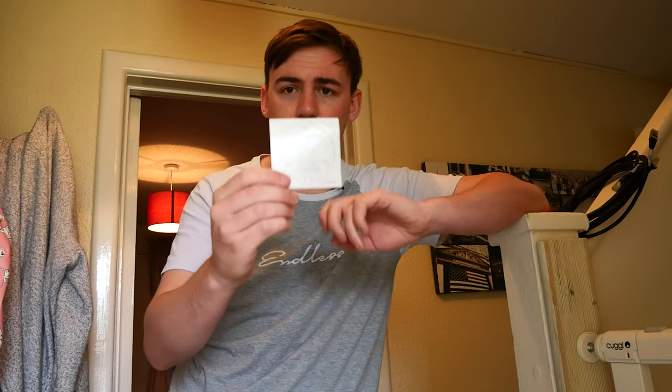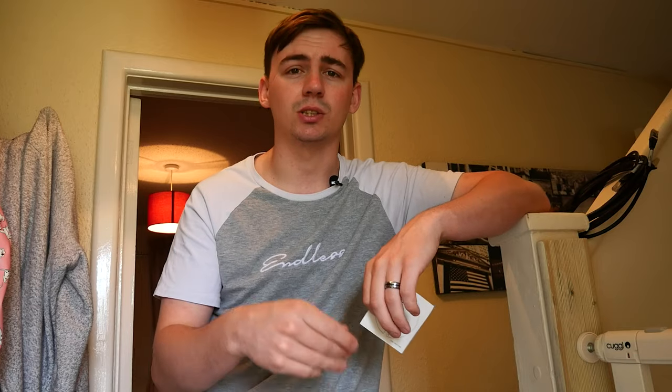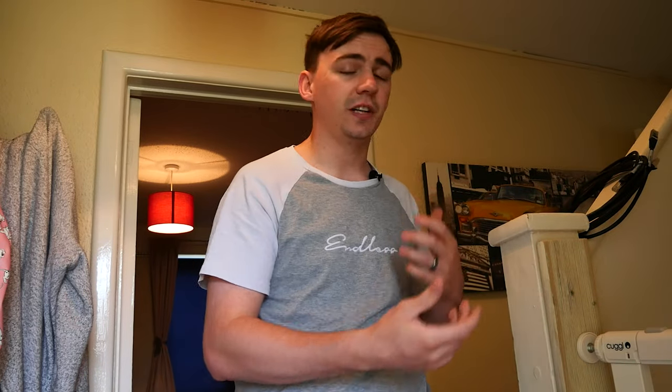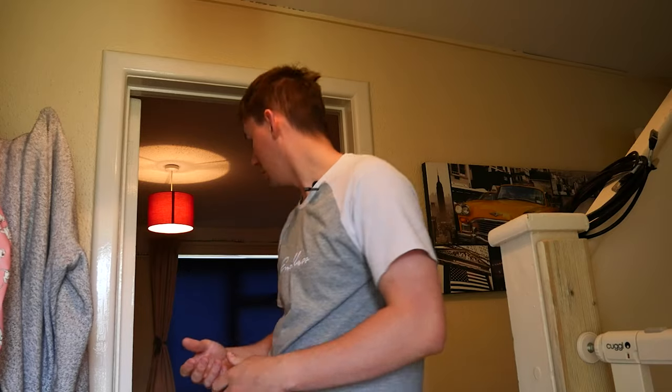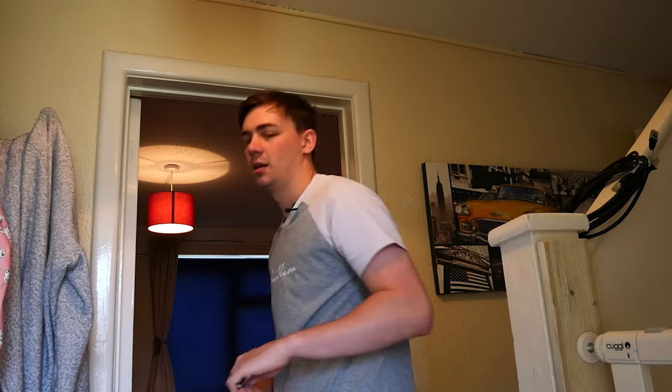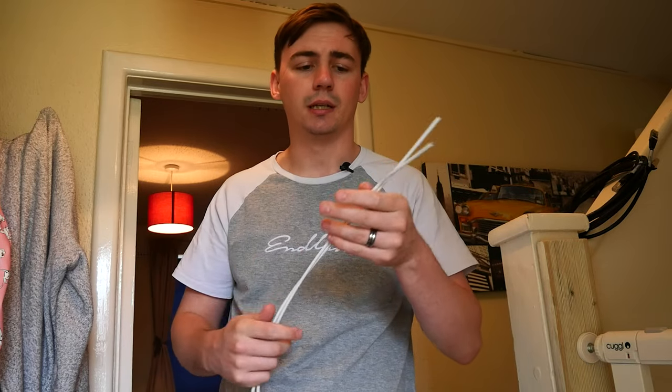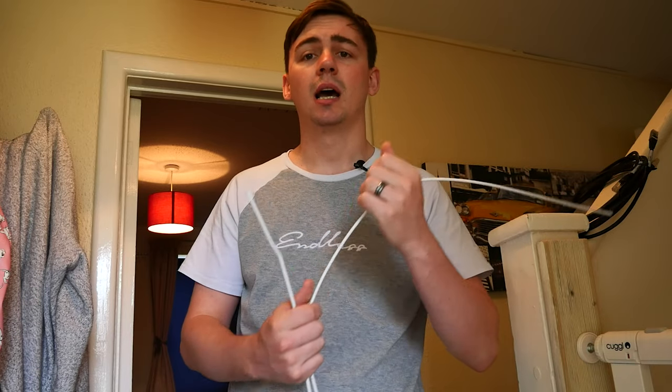So I am going to be using the drilling template. I'm not going to be obviously talking directly to the camera while I'm doing this, so I will talk over it, explaining what I'm doing. Now, normally with the amount of space you would have, 9 times out of 10, you would attach a fishing wire to your cable. But I don't have a fishing wire. So what I'm actually going to be using is some wire threaded cabling. So this is going to allow me to attach my Ethernet cable to this, push it through and then back out so I can connect all the wires up.